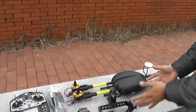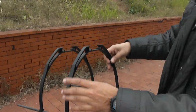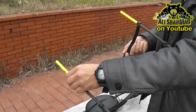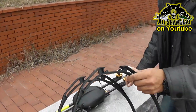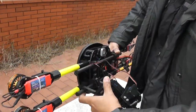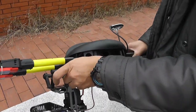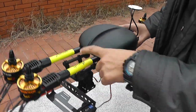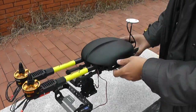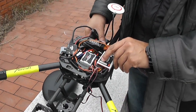When you get this quadcopter it will be similarly like this. The landing gear won't be folded — it will be completely opened, so you need to install these two rods on the landing gear. They just click fit inside. The camera gimbal is also just click fit. If you experience vibrations, you can add more foam and padding on these two posts. The camera gimbal will then plug into the F1 and F2 ports.